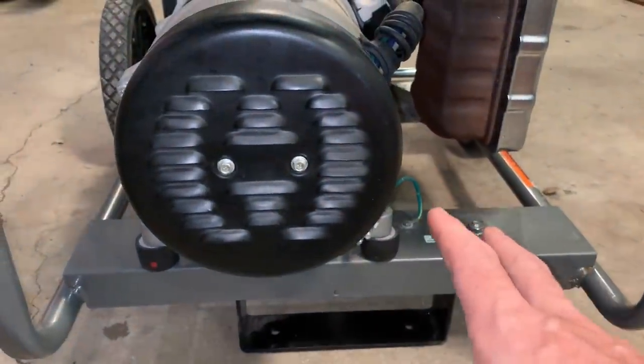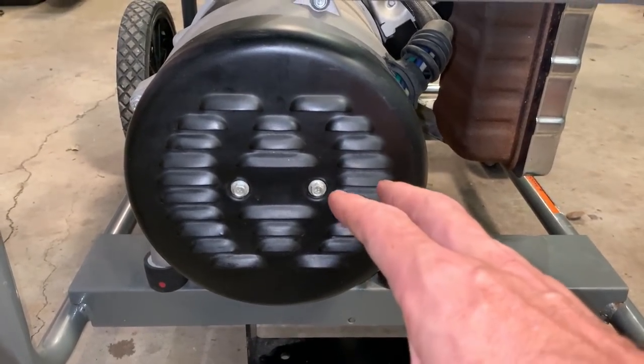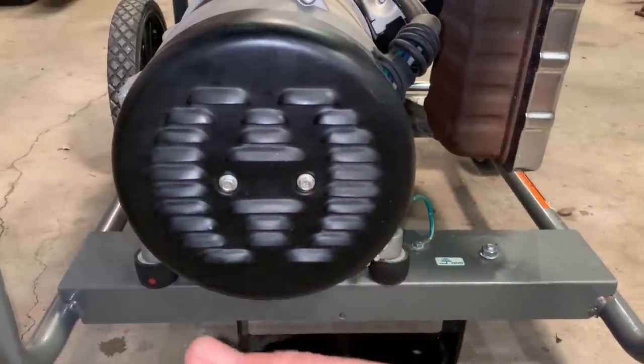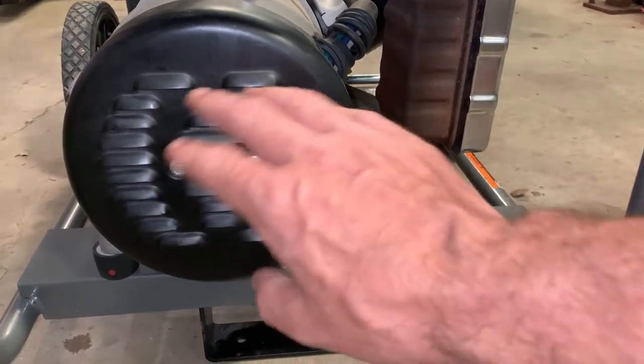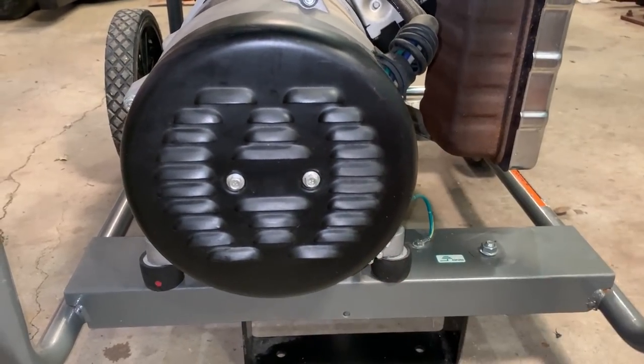So if I'm really lucky, I only need to remove the brushes. And if the bearing doesn't hang up, I can just slide everything out. If I'm unlucky and I need to use a puller, then I'm gonna have to pull the wires, the AVR, and just get it all out of the way so that I can get the stator off.